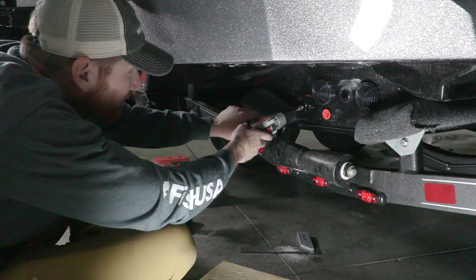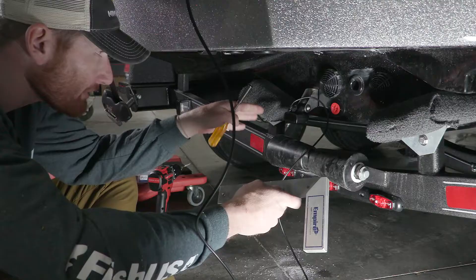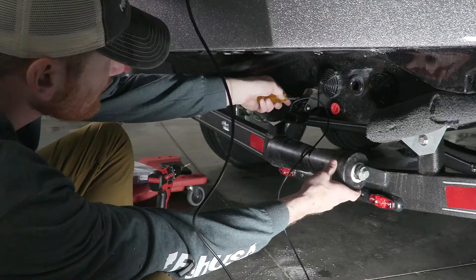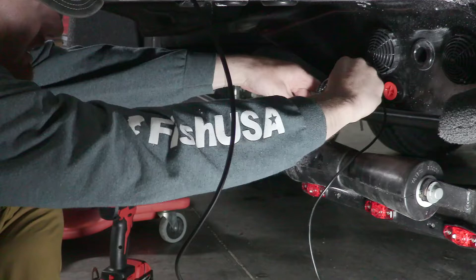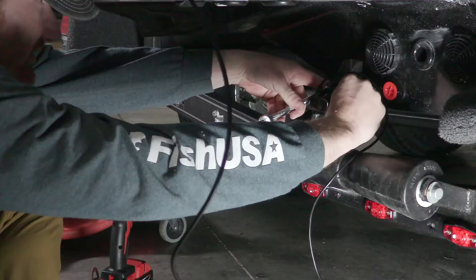After you drill the holes, you're going to want to put a little angle or chamfer on there, just to make sure that the fiberglass doesn't split out or crack over time as you secure it. Now that I'm happy with the height and the angle — just above level with the boat, slightly kicked up in the rear, and level from left to right — I'll secure it by hand so I don't over-tighten it or move it. Then I put the nylock nut on and use a small Allen wrench on one side and a 7/16th wrench on the other to secure the transducer so the angle cannot change.